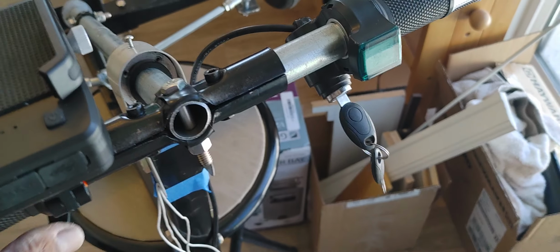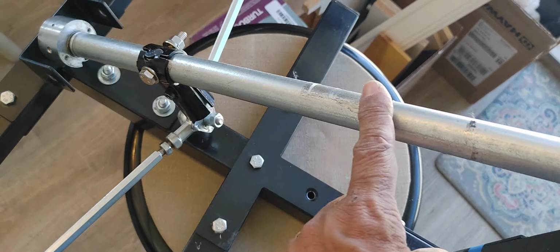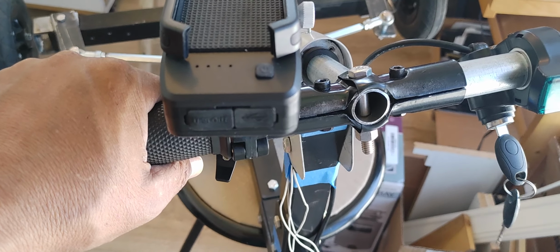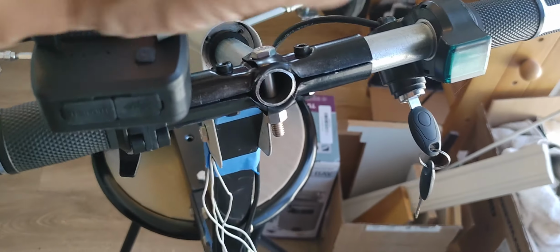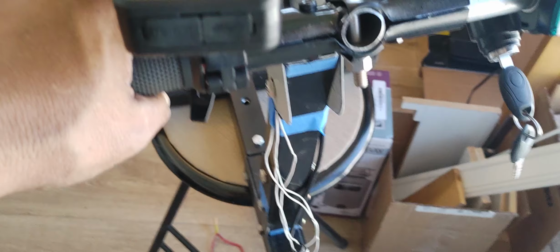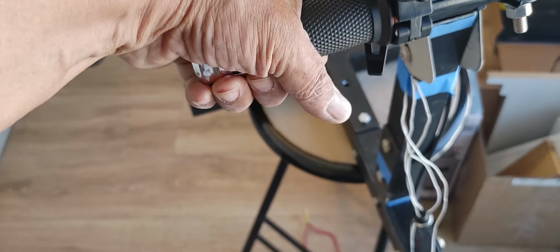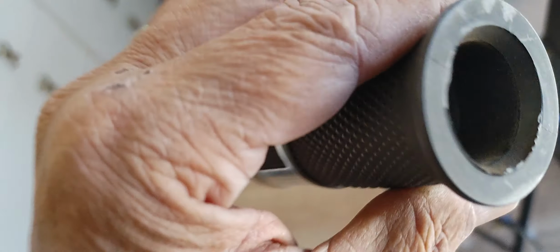So I'm going to do that, but I'm also going to use a single piece tube. I want to change this to just a regular bracket like that, so that I can go with a full length instead of two side tubes. That way it'll have a little more positive mechanical feel. Because this does have a very minor wobble, but it's things that bother me. So I'll have a full bar right here, and I'm going to have to do the same thing to the other side of this bar, shave it so that it fits. Actually, this one I don't think I need to do anything to, because this one has a rubber. Yeah, this is just rubber, so the rubber fits over that with a little bit of pressure, which is fine. I'd rather have a little pressure there than be too flimsy or too loose. So that'll just go straight in.